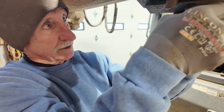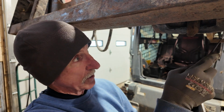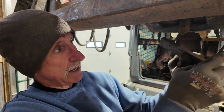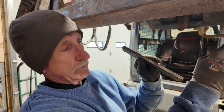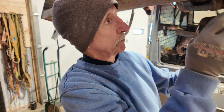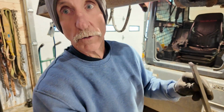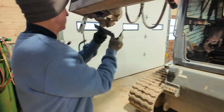So we're going to mark this like that. Okay, now we've got our mark there. Now we can pull this down, we can grind this, get this squeaky, shiny clean and this squeaky, shiny clean. And what we're gonna do is just hang this off of here. We're just gonna tilt it forward, this will hang off and we can weld it. Same over here.